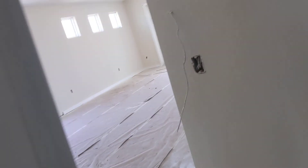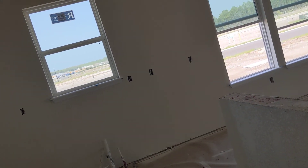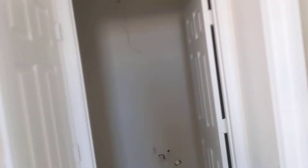The blue tape marks where we're gonna need to add caulk and paint touch-up, but that's not for today or tomorrow. There is no sense in having the painters come back today or tomorrow - we gotta get cabinets in here. They could bump a wall moving those cabinets in from the garage. Here comes the countertop - they're probably gonna bring it in through the back, they could bump the wall. We got electric trim coming, plumbing trim - he's gonna be putting toilets in there, faucets. There's no reason to have drywall guy or paint guy come until after that stuff is installed.